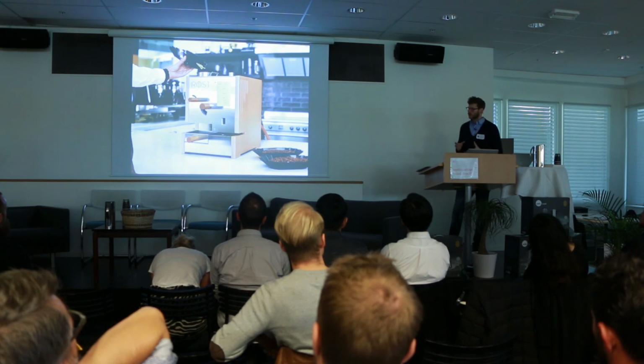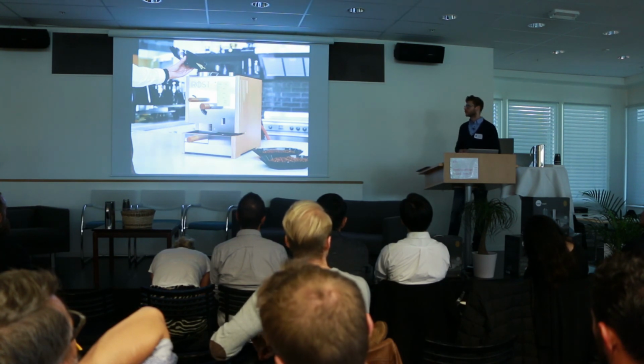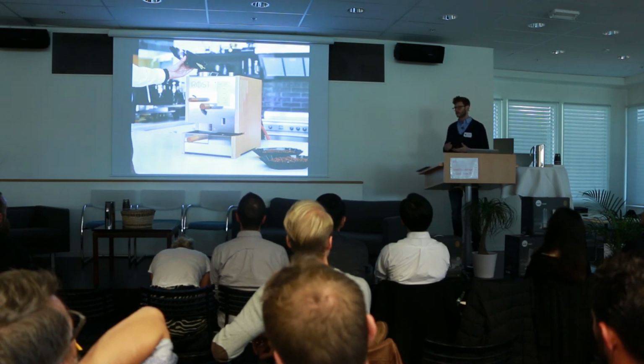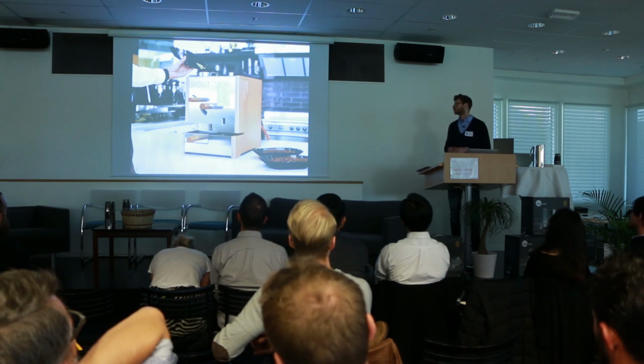So we ended up with a dual ventilation system. The ventilation system is separated for the roasting chamber and the bean cooler. And this is to optimize back-to-back roasting capacity. And you can also play around in making profiles for the cool down period.